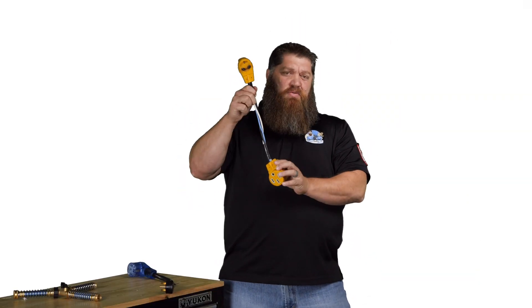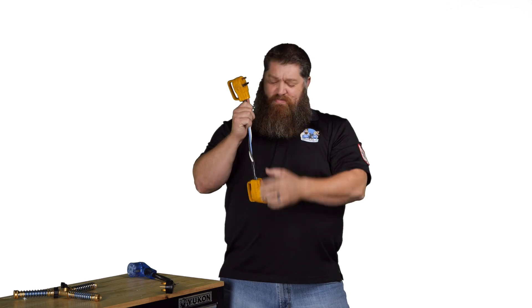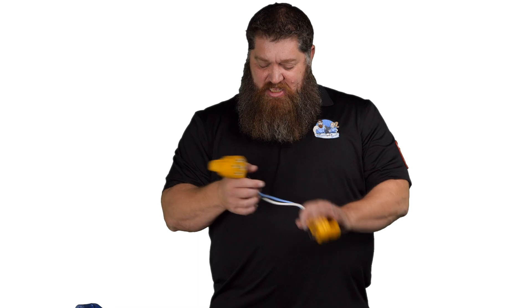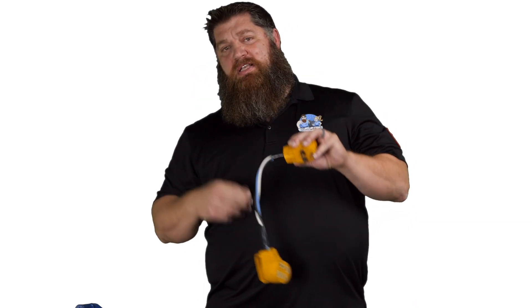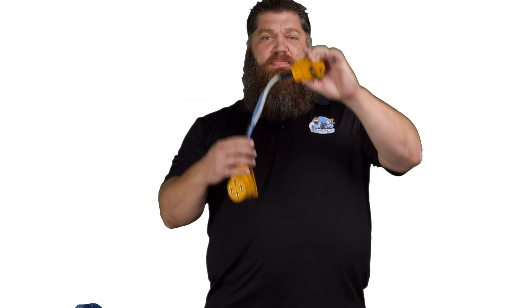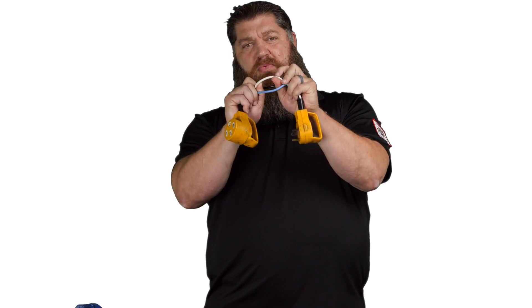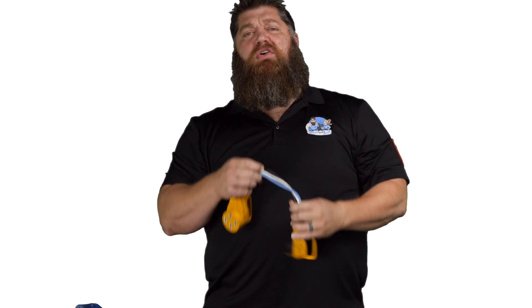First, let's cut away the sheet to show you what it looks like. Here we have 30 amps going into our 50-amp connection. Now, last week we went over that a 50-amp service gives you two legs. So if it has two legs on your 50-amp, look carefully at how many wires are on this dog bone — there's only three. We have our black which is hot, our white which is neutral, and our green which is ground. We don't have that second leg.